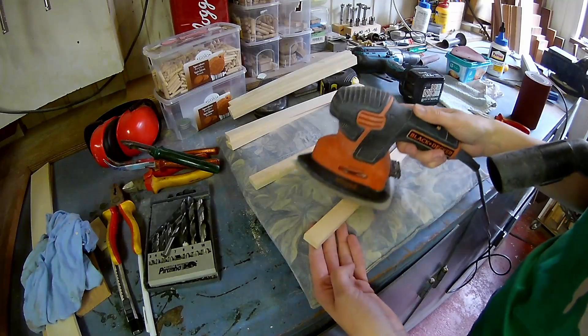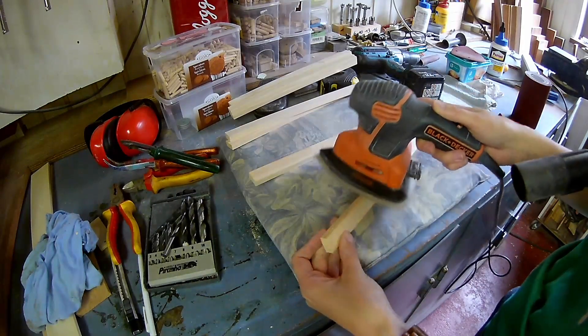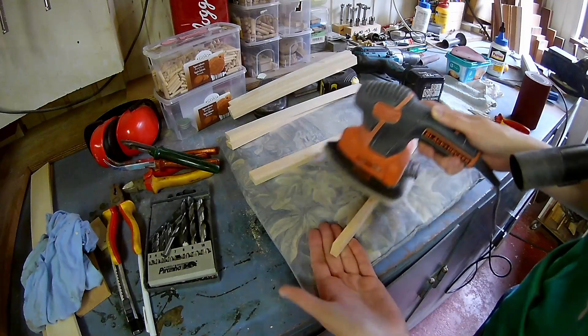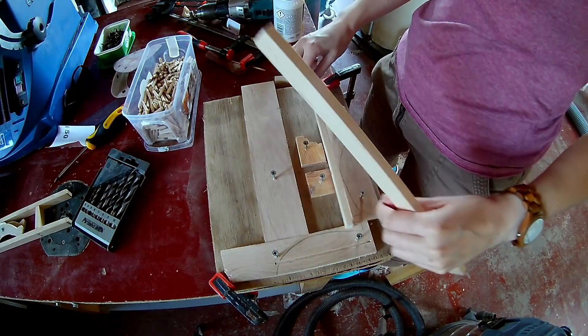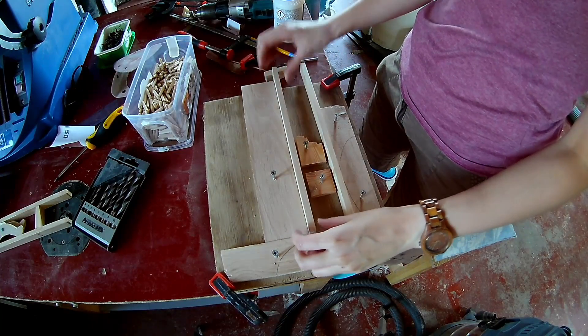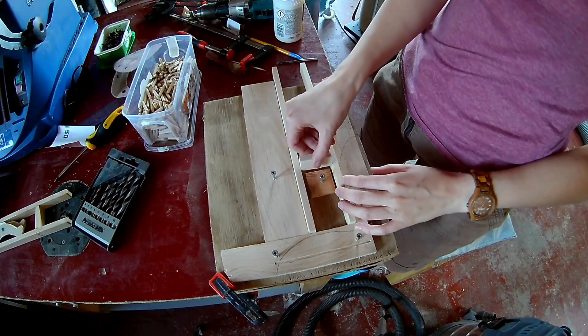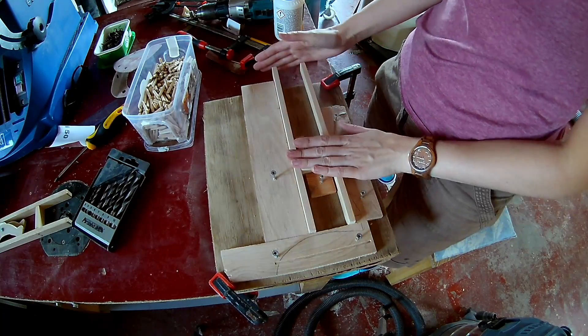For the frame I'm using 1cm by 2cm lumber. The length is 30cm. Also drill 2 holes at the top of the frame with the same spacing as in the arms. The little piece in the middle is 14mm by 2cm, and the length is 45mm.